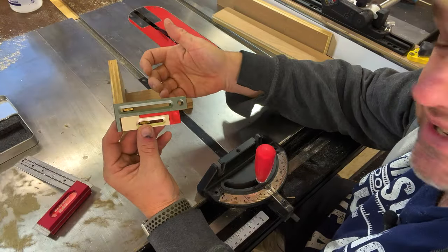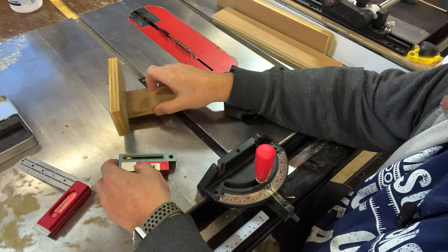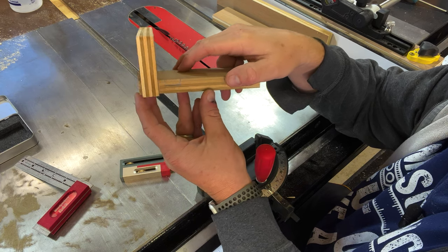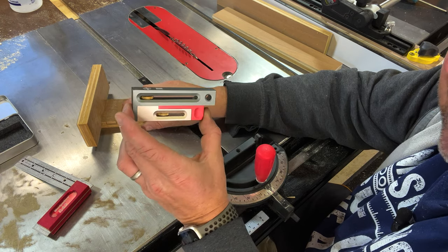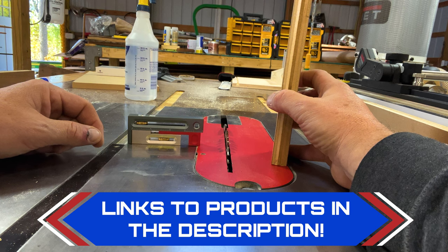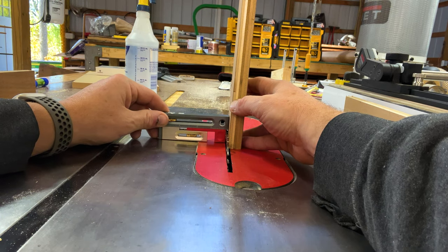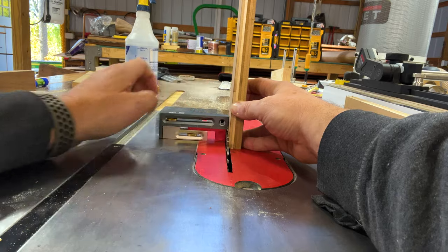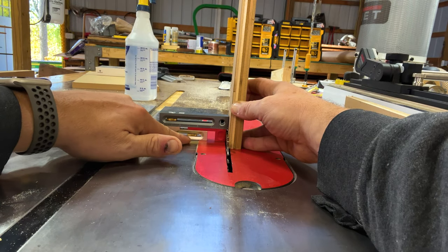This tool may seem a little intimidating — it's got a lot of moving parts and two knobs that allow you to tighten those parts. It's used to make perfect dados and rabbets. As you can see from this test piece I did earlier, this dado is absolutely perfect for three-quarter-inch plywood. The real strength of this jig is that it allows you to account for the kerf of your blade when setting up your dados. To set it up, you push your workpiece until it touches the blade, push the gray piece until it touches the workpiece, then push the red tab until it touches the other side of the blade. Now the saw blade is sandwiched between your workpiece and the red tab. Once everything is aligned, you tighten it down by screwing the knob.